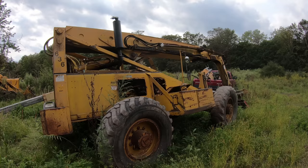So that is the capacity chart. Basically, if you have the boom all the way retracted, you can do 6,000 pounds from anywhere on there. And then it gets less and less the further you extend the boom out. So the least amount is 1,500, and that goes up to like 35 degrees. And then after that, it goes to 2,000 and 3,000 and 4,000. So I guess you can do like 36 feet from the center of the forks to the very highest point. But at that point, it's only 10 feet out. So getting that high is something you'd have to be right on the side of the building for.